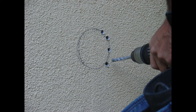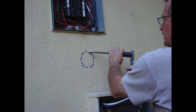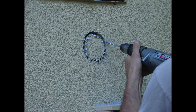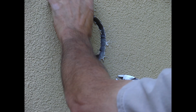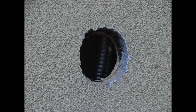It's just a process of drilling holes and chipping away. You can use a masonry drill bit to enlarge your holes and get that material pulled out. You chip away with your Klein's electrician's hammer and screwdriver to knock out all the stucco, then get in there with a pair of pliers to cut the chicken wire that might be in there for the stucco. Using crimp pliers with a pointed cutter allows you to get in, cut the wire, pull out the piece of concrete, and then get started with the hole saw bit to make a hole into the wall.